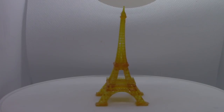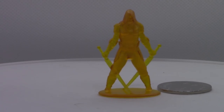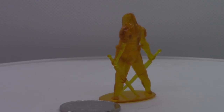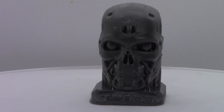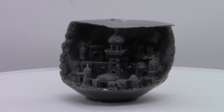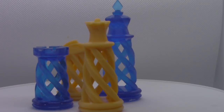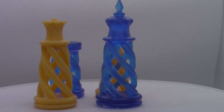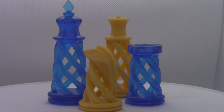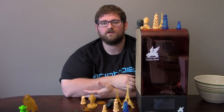The quality of the prints delivered by the Shine has been absolutely fantastic. Those used to FDM printers are going to be blown away by the fact that layer lines basically don't exist. Because you're not squishing down layers of plastic extruded as a bead, the layers cure and adhere perfectly to each other. The only time you'll see layer lines is on curves, where individual cure layers can't smooth them out enough to make them disappear. The printer is capable of going down to 0.02mm, but I never felt the need to go beyond 0.05mm because it delivered such fantastic quality.